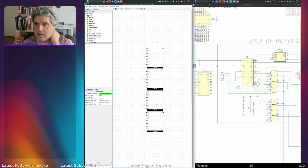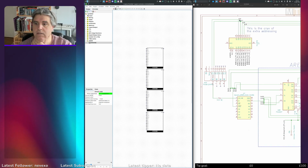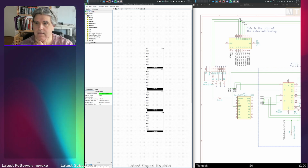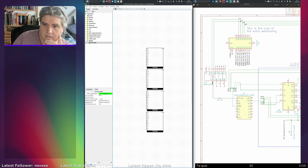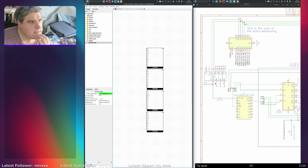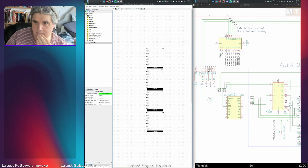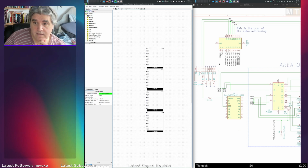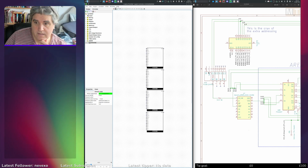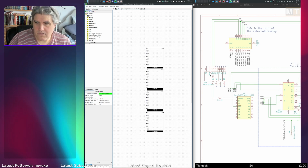We've actually got an A8 pin here, which is for the larger chips, which is coming from 16 or 17, depending on the state of this mux here. And there's nothing there to say what that mux is. Okay, I'm going to need to know what those are before I can do anything. Right, okay, so I can ignore that for the moment.